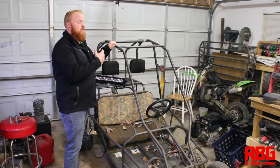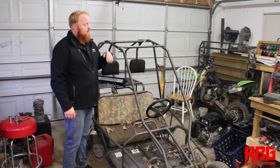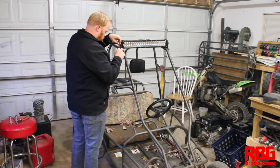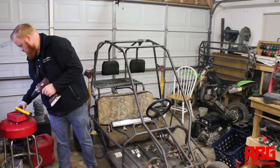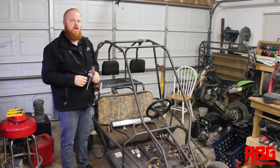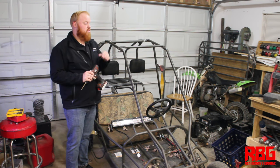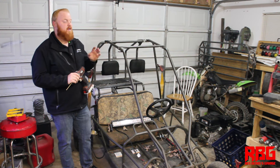How I decided to mount the light bar was to take two 2-inch pieces of 1/8-inch thick flat stock and stick them out about an inch on each side of the pipe, then weld them into place. I'll lay the light bar on it, mark my holes, drill them out, and bolt the light bar on. When drilling, I start with a really small drill bit and skip about three sizes each time — that way you don't wear your drill bits out as fast and it's a lot quicker than starting with the final size and trying to hammer it through the metal.